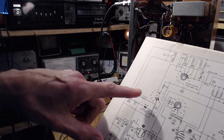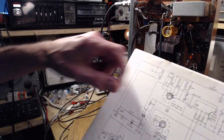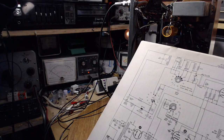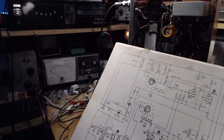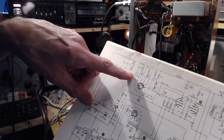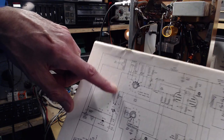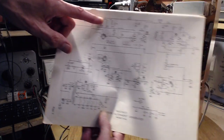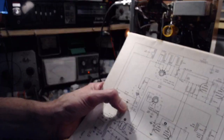I guess all these resistors have been set and contrived to put the right amount of bias current through the inductor primary. Actually, last night when I was ohming this out, I tried and tried and tried, but I couldn't do anything that gave me any impression that I was doing a valid test, because there are too many connections and stuff going on in this. But at one point I suddenly realized, oh my god, this could be open. If this is open, this thing's finished. But I don't think it's open. I think the problem is here.